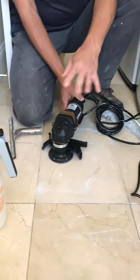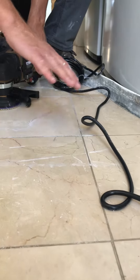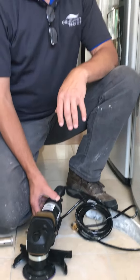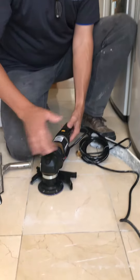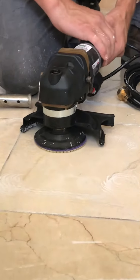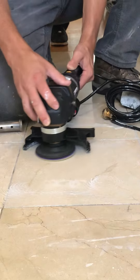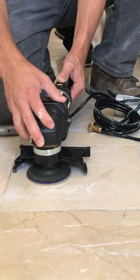We've already started. As you can see over here, there's mild etching, but we can go through and take all of this out by smoothing out the stone, and then after that we will start bringing it up to a polish. I always like to put the machine right on the surface like this and then start it off. The reason we leave it on the surface is it helps to keep everything smooth and flush. We just go over this until it feels real smooth.